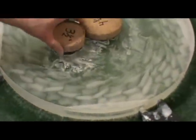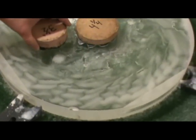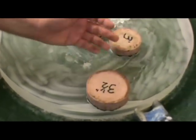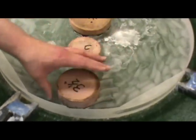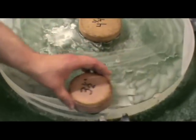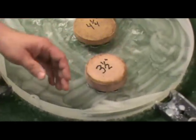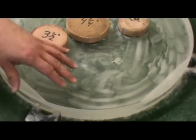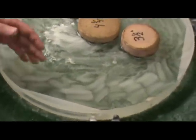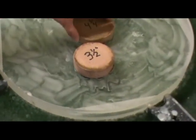So those are a few different techniques that help keep the mirror smooth so you don't see marks, and also blend your action so you don't have discontinuities in the zones. The first point is to make that star pattern on your pitch lap. Second, sometimes use straight strokes and sometimes use long, thin elliptical strokes. Another technique: use the V — one, two, three, V inside. And for both the rotation and V strokes, you can change the count, doing two, three, or four before the V. Wait until your mark comes and then change your pattern.